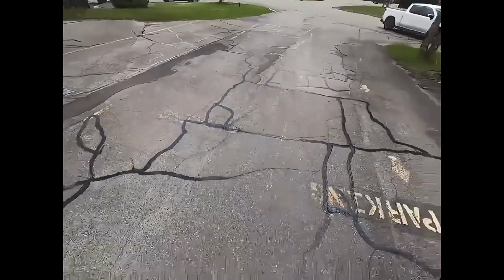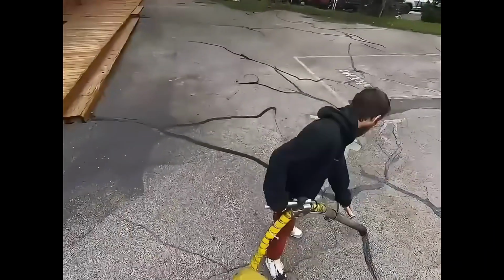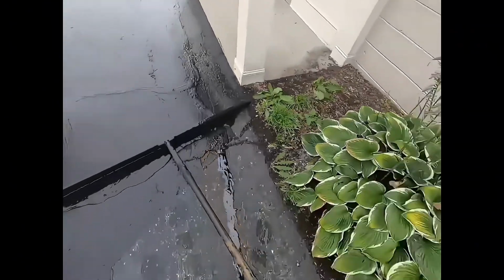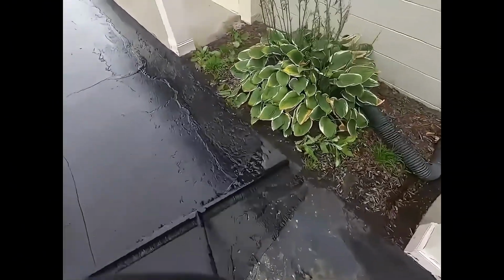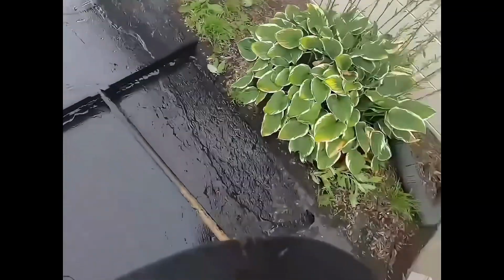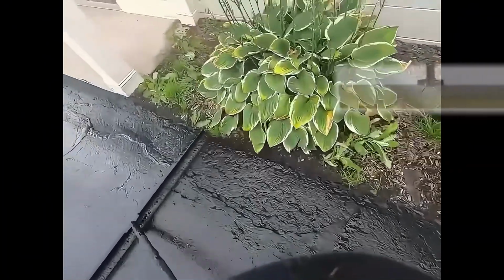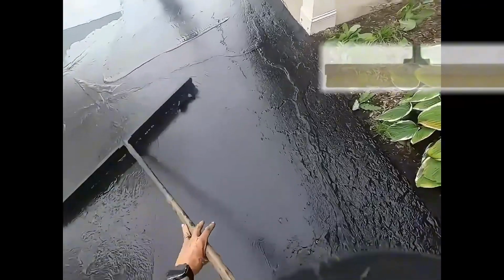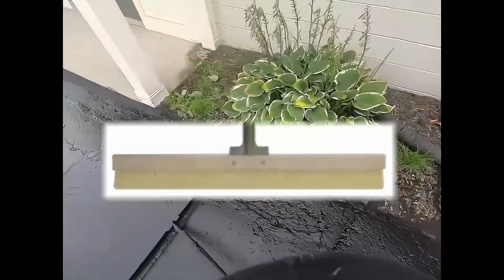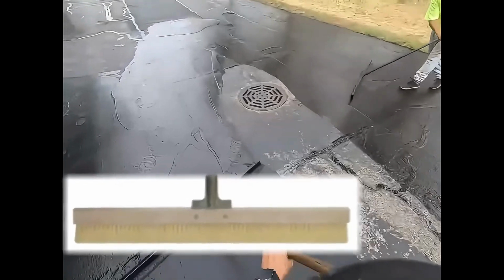And now that we've covered the sealer and the types of sealer you can get, let's talk about the other tank and what we're going to put in that, which is the brushes. So our company, we use the big brush. We call it the big brush. That's what it's called. It's a 55-inch natural fiber. You can pick them up through Sealmaster. I think there's a couple other companies that may have them. I'm not talking about the crimped metal brushes with the black fiber. I'm talking about the beige, tannish bristles with the balsa wood brush.